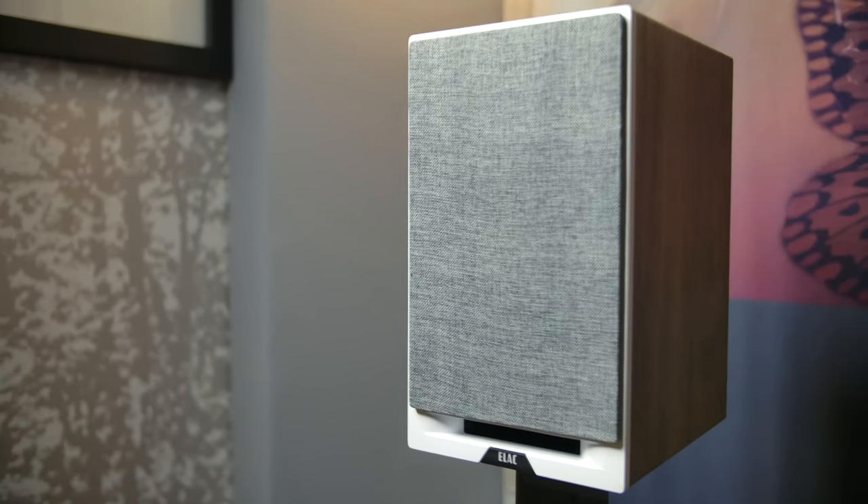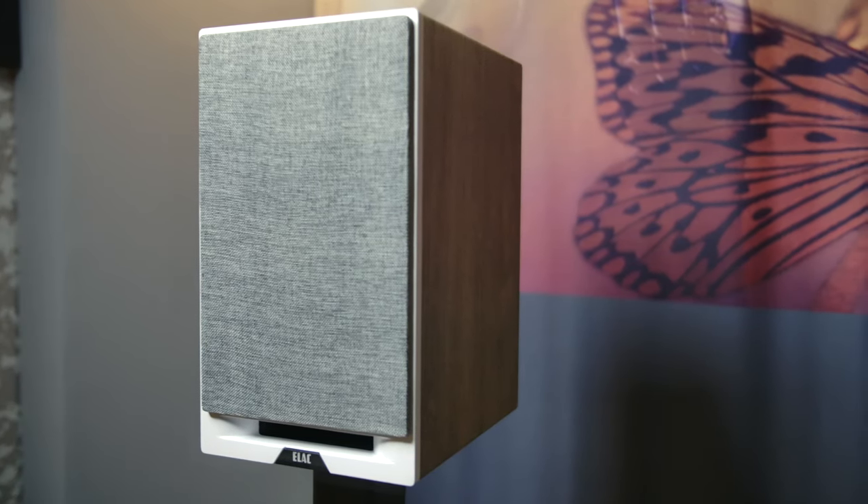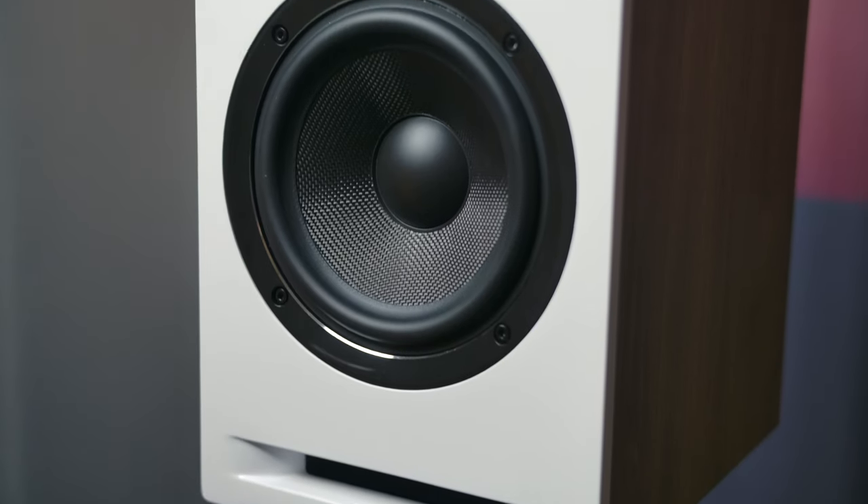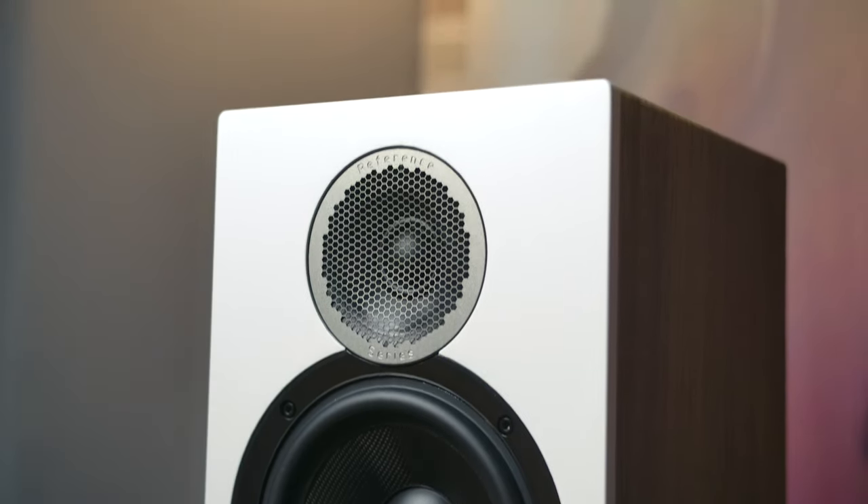In the new version, I've gone for a stronger, stiffer cabinet with much better bracing — peripheral bracing on the inside. I've taken the woofer, kept the same moving parts and magnet, but put it on a cast aluminum chassis, so it's much stronger and you don't get that resonance. The tweeter is mostly the same but has a new waveguide to better integrate it to the baffle, and a new more open grill mesh to not roll off the very top end — now it's 6 dB down at around 40kHz. I've also upgraded the crossover, not so much in component quality — it already had laminated steel core inductors for the bass driver, air core inductors everywhere else, and film caps on the treble section — but I've added components to flatten and control the response and get it more linear.